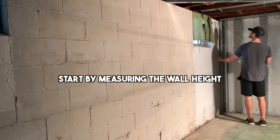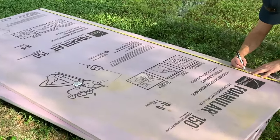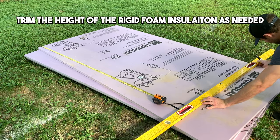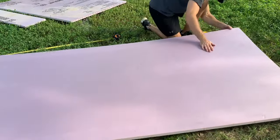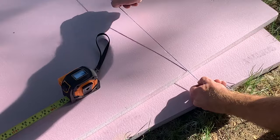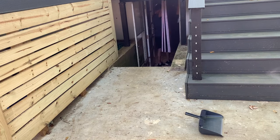With everything out of the way, the first step in installing rigid foam insulation is to measure the height of your basement walls. In my case they were around seven foot eight inches, so I had to trim a little bit off the eight foot sheets of this rigid foam insulation, which is made by Owens Corning under the name Foamular. I marked the height and then used a six foot level as a straight edge, and you're going to use a utility knife to score along the surface of the foam, then snap it in half. It cuts pretty similar to drywall in terms of the score and snap procedure. Repeat the scoring and snapping procedure for all the pieces needed for your project.